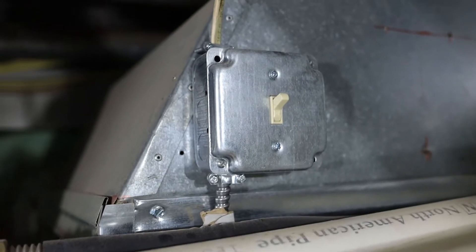Until we know for sure that this isn't asbestos, we're going to treat it exactly like it is. We're going to wear some protective gear and make sure the HVAC system — if you've got a forced air system — is turned off so you're not circulating any of this stuff when you disturb the material. We're going to pull a piece of tile down and then we'll have a sample to work with.